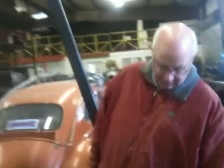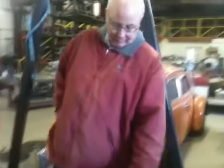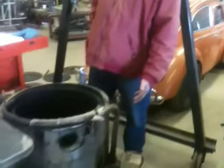So what you do is you pump the water in the bottom, and the bottom has smaller diameter coils, piping. So the water starts out cold and comes up. The hot gases start out hot and go down, so that's your counterflow. What you're trying to do is extract all the heat that you can out of the combustion gases, and the only way to do that is to have the cold water at the very last, the very last thing the gases touch. That's why we call that counterflow.